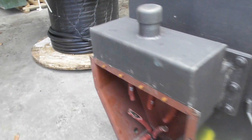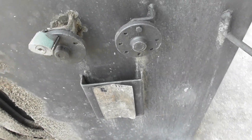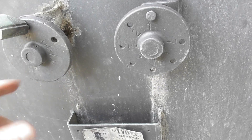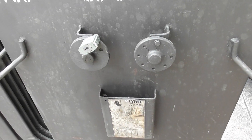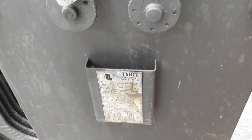These transformers will have two tap changes. You've got one selector for your 11 kV and your 6.6 kV — so that's locked in at 11 kV. That's your tappings for your winding. And the same applies to this transformer as well. You'll be in for smoke if you put it on the wrong setting — I think it will burn out.